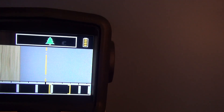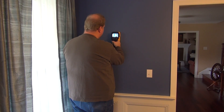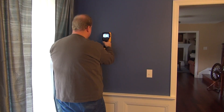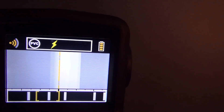We're going to come across the wall — nothing — and then I got a stud here. I can tell when I look at the sheen of the drywall that there's some mud back there, so there's a screw. Now I get to a place and it's telling me there's a PVC pipe. I know this is actually true — if you look around the corner in the bathroom you'll see a toilet, and this is the vent stack for that. There's another PVC pipe listed, and a third PVC pipe. Down in the basement right below this is our boiler, and the fresh air and return pipes were framed into this wall — so three PVC pipes, not a surprise.